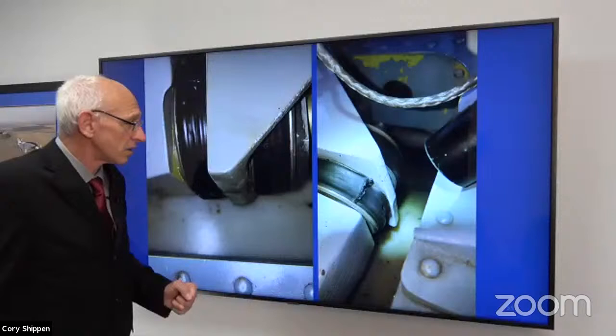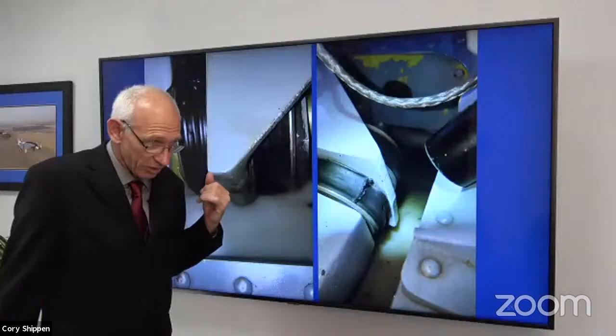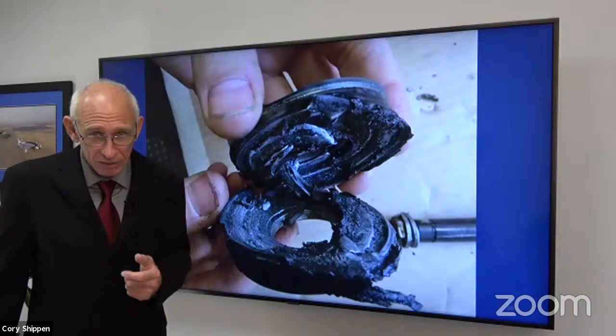This right here, typically you see this kind of damage when it's wet because some kind of a petroleum product got on there. It could be main gearbox oil, engine oil, could be hydraulic fluid, anything like that. If you get it on there, leaks happen, wash it off and your laminates will last longer. Extreme case of a laminate that was not okay, right?